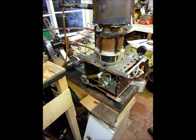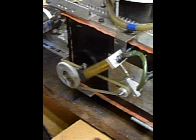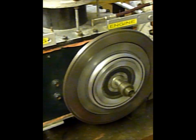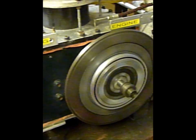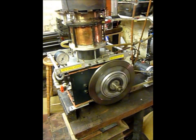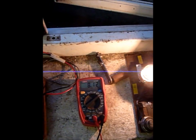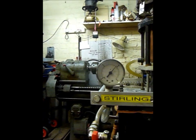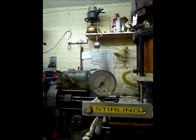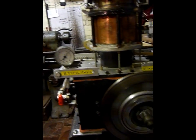Here's the gas pressurisation pump. With more molecules in the engine, there's more energy to drive it. So there it is, pressurised to 10 psi, making 8 volts and driving an air pump, a cooling fan, a water pump, and a 75-watt bulb — all from a smaller diameter engine, 4 inches rather than 5 inches, and a lot shorter. The interior fins make all this possible. They support a far greater heat transfer and can heat the greater pressurised volume of air.